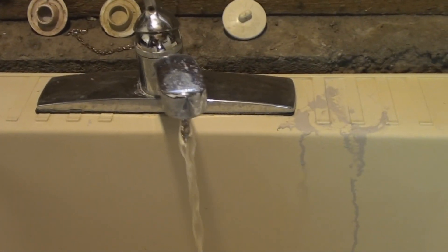I've already turned off the water and let the system drain by opening a faucet at the lowest point and letting all the water run out through that. To speed that up, I went up to the highest point and opened the valve up there to let the air chase all the water out.